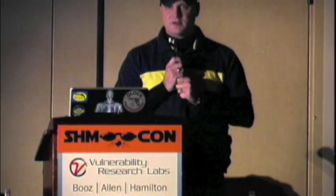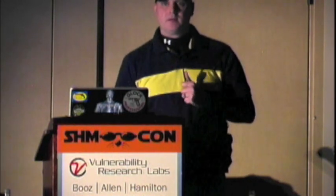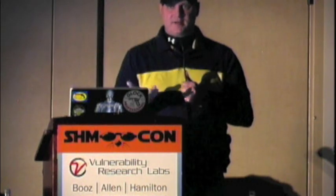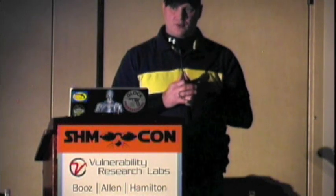Yes, sir. Next question? And the second question from the streams was, how much of this technique applies to solid-state drives? Not very much of it. The only part that really applies to solid state is similar to this resistor problem that we have, where we have a transient voltage suppressor. USB memory sticks and a lot of the solid-state drives will have a similar resistor pack on their disk.